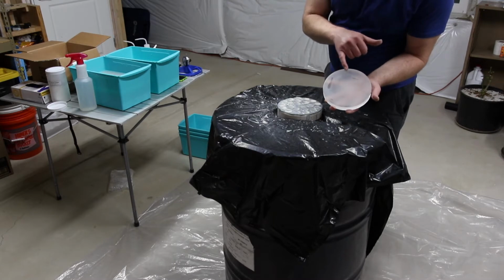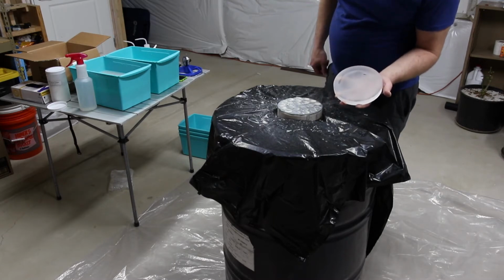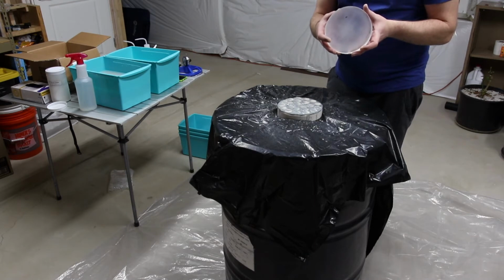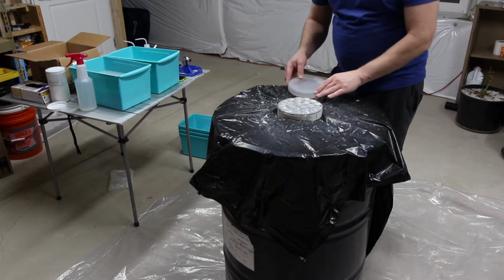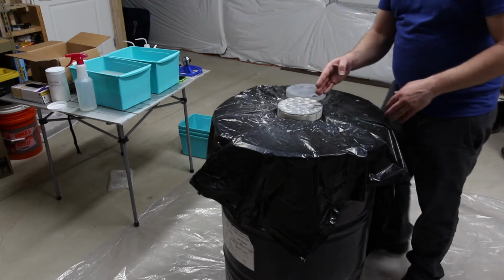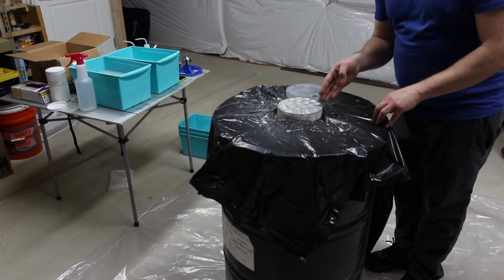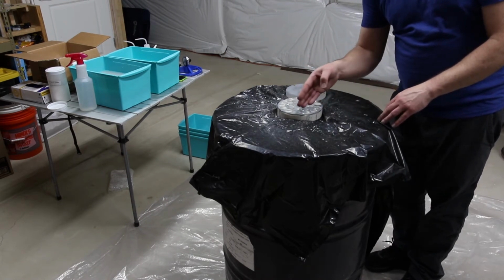You can kind of see there's some little spots here that maybe haven't gotten quite as much, but as I keep going, it should gradually even itself out. But you know, as I'm going, it's grinding. It's definitely taking some material off in the middle by doing those chordal strokes. Remember, chordal, kind of along the edge, and then as I go, rotate the mirror the opposite way a little bit, and then again, keeping the center of that mirror along the edge here.